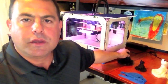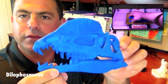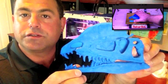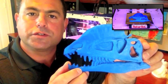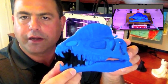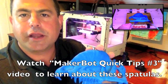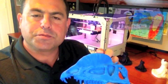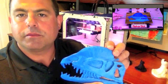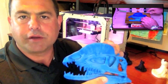Just before I show you the time-lapse, I have another print here from Thingiverse — another dinosaur fossil. I'll put the information down below the video so you can find the links if you want to download these STLs. You can also see if other people post photos of their prints — different colors, different kinds of plastics, different layer heights, different speeds. I'm trying to maintain the best quality I can at the fastest rate I can get. Right now I'm printing at about 48 millimeters per second with version 5.4 of the accelerated firmware on the Replicator.